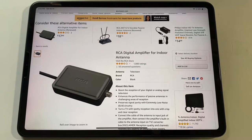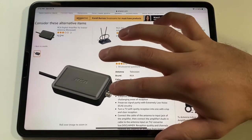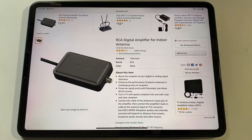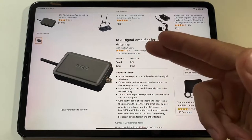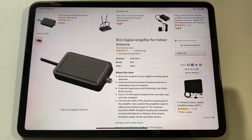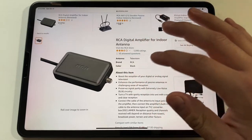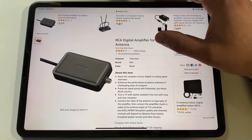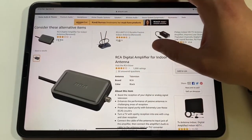From there, a six-foot cable goes to the TV in the bedroom, and then probably at least a 50-foot cable — coupled with one break in it — goes out to the living room. It's not the cleanest setup but it's been working better than anything else, better than two separate antennas. You can't buy this exact amplifier anymore, but there's Winegard, Channel Master, and other preamplifiers you could buy, plus cheap ones like an Antop. Whether you need one is arguable, but for me, if I unplug the power to this or to the powered splitter, it won't work as well.